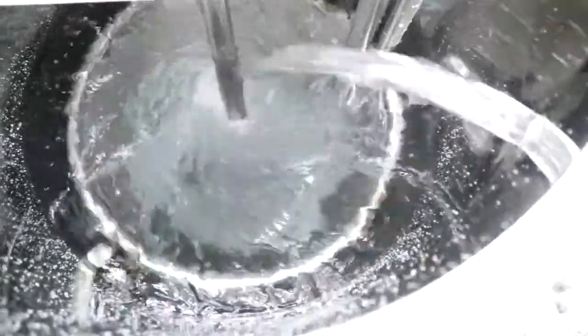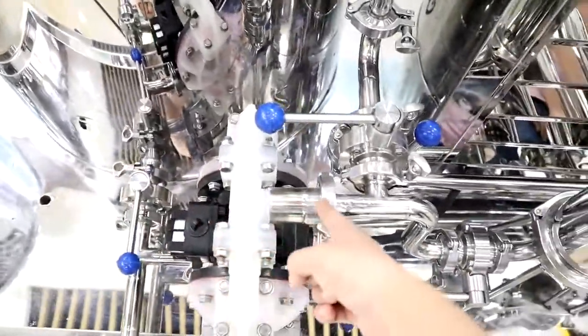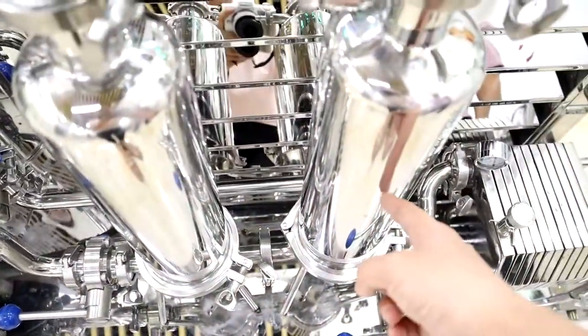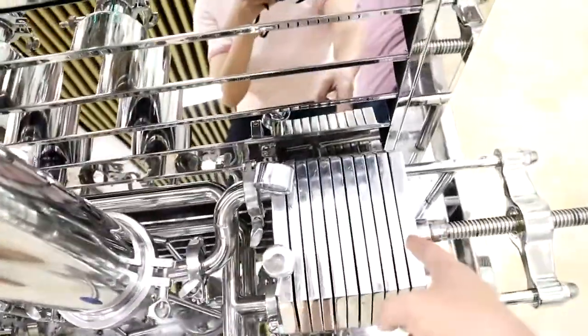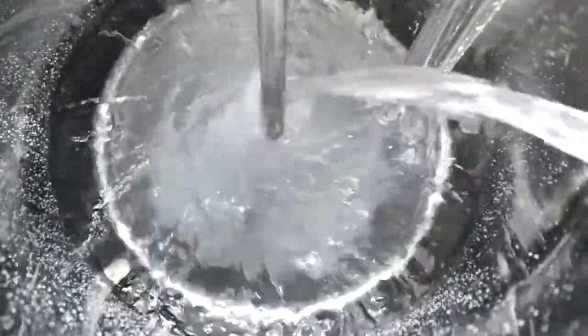Now the product is being refrigerated. The flow direction through the filter is as follows: from the inlet, it goes to the pneumatic de-ferrum filter first, then to the dual-stage filter, then the three-stage filter, and out from here. Then it goes to the circulating tank, then to the outlet. The product will then be refrigerated.